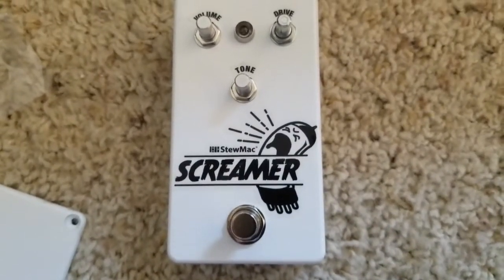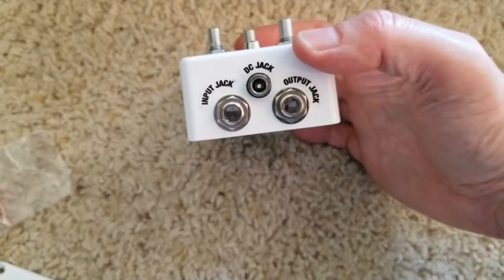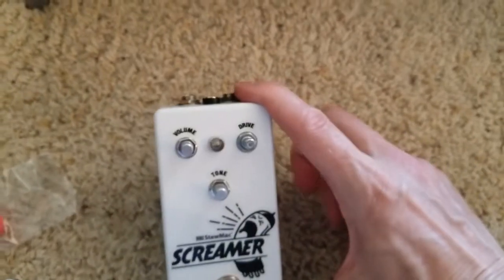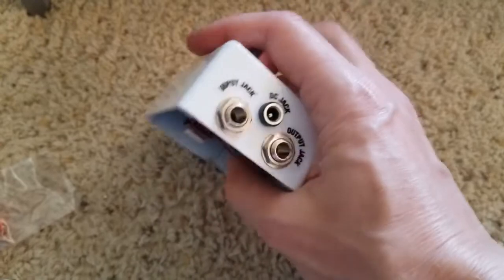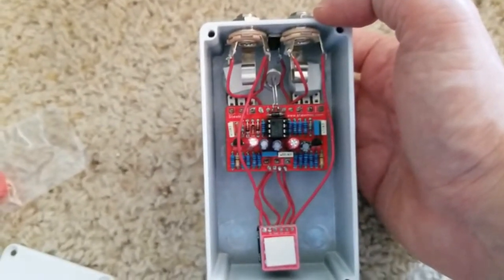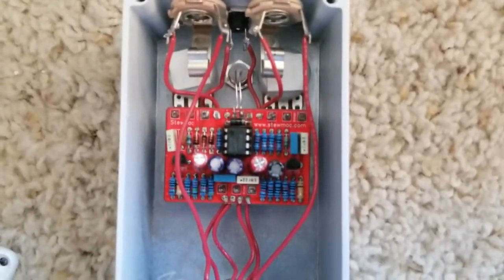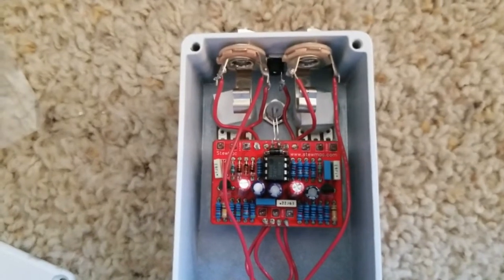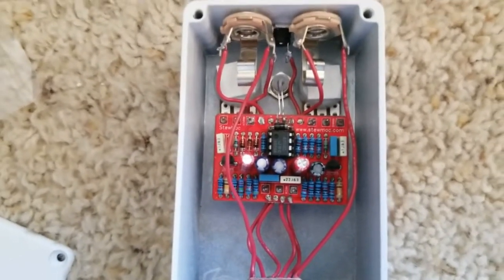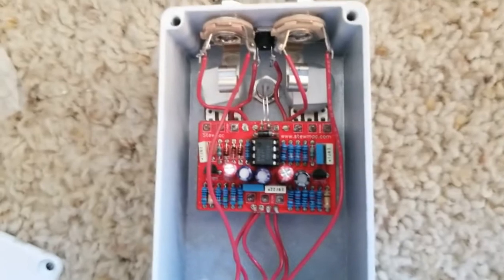There's the stickers on there. It's not, you know, beautiful, but it's not hideous either. So I'm digging it. It was quite a learning experience going through this whole process. And what I've learned is my soldering skills are not that good. A lot of problems keeping the iron tip clean. I couldn't get a lot of effective transfer of heat. Various temperatures and such, but enough about that.